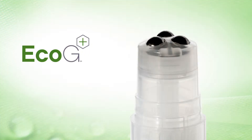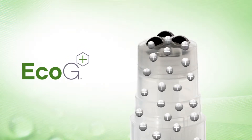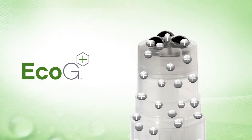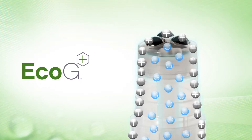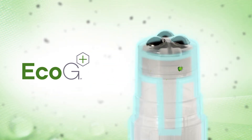When any common antimicrobial material is injected into plastics and the plastic starts to cool, the antimicrobial ingredients actually cool more slowly than the resin itself, and the result is the antimicrobial ingredient is trapped inside the plastic. With Eco G Plus, our glass beads allow the resin to all cool at the same time. As a result, the antimicrobial ingredient is significantly found on the surface and able to do its work to prevent bacteria and biofilms.